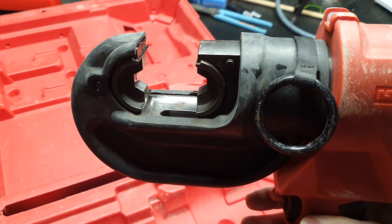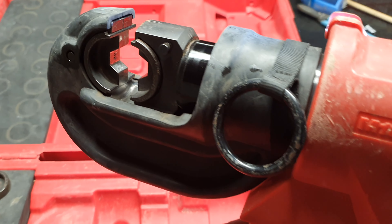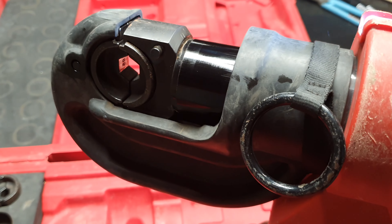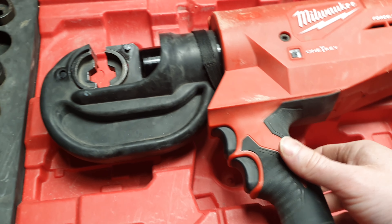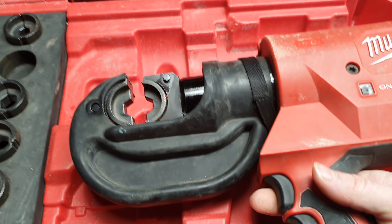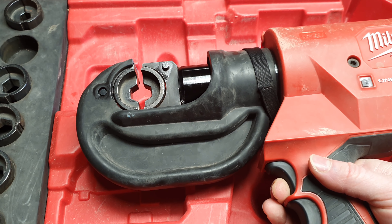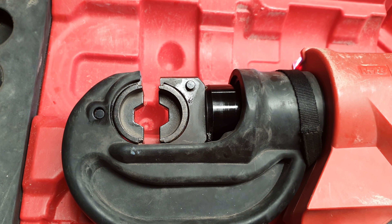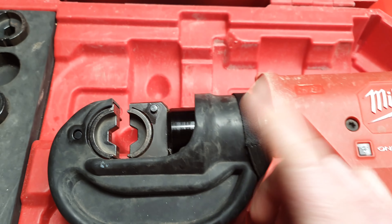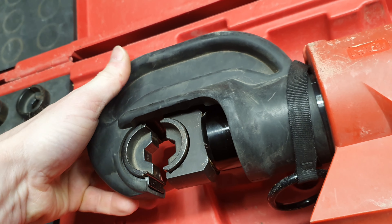You've got a go trigger and a release trigger. Slow and steady. When the compressor kicks in, you get a little green LED light here. You can pump it all the way down — if you're doing your crimp — and once you've gone all the way down, the green light lights up. You can then release just enough to get your second crimp on if you're going for two crimps, and off you go.